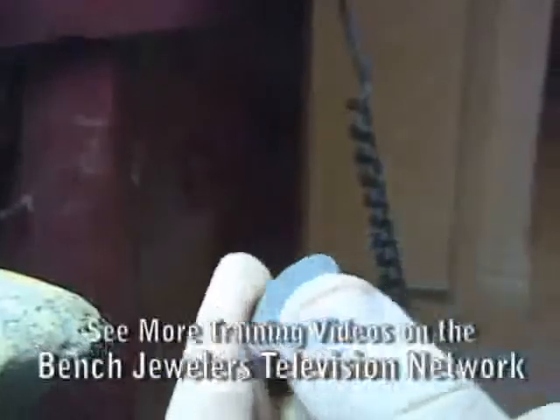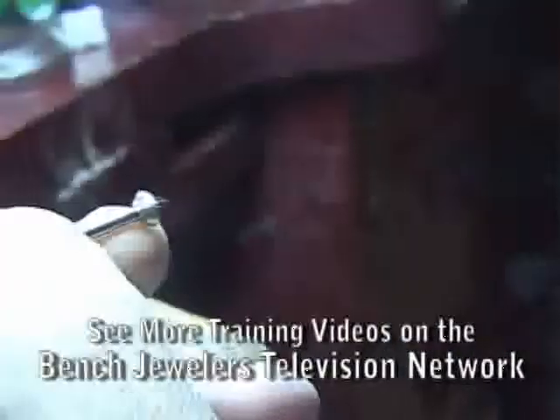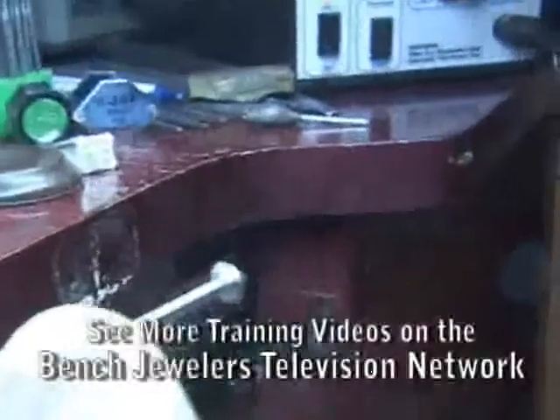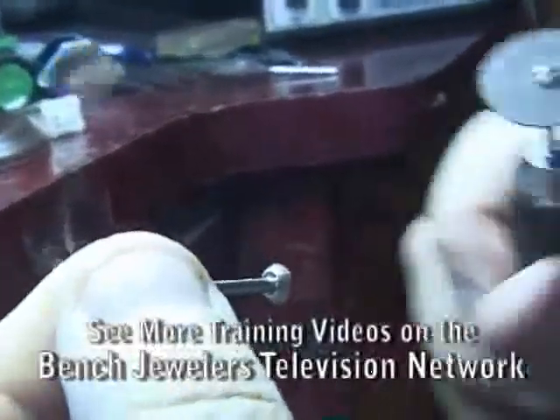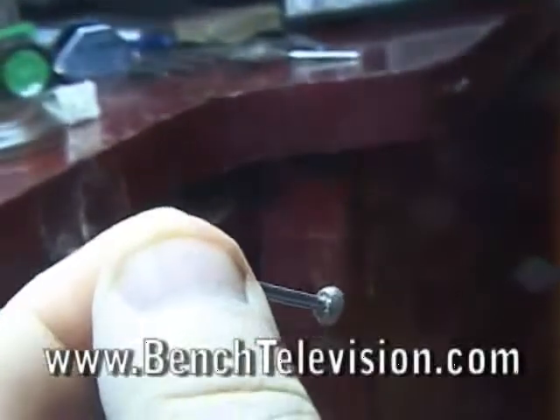What I'm going to do now is get my black carborundum disc and redefine the teeth on a high-speed steel drill. Some of these little guys cost about $10 each, and once the edges are worn down, you're not going to throw this away, are you? No! I'm going to show you how easy it is to redefine the shape and cutting edge on one of these little darlings.